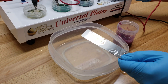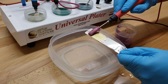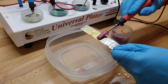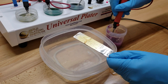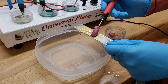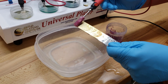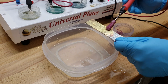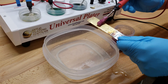I'm going to turn it up to about 4.75 volts and just gold plate it. You can actually crank it up while plating — sometimes you can be at 5.5, sometimes even 6 volts if you're moving constantly like I am. If you stay still in one spot, you can get burning. But if you get burning, you can always clean it up with a little baking soda and water — most burning will clean right up. But if you notice it's burning, stop — there's no point in continuing. Turn your voltage down.